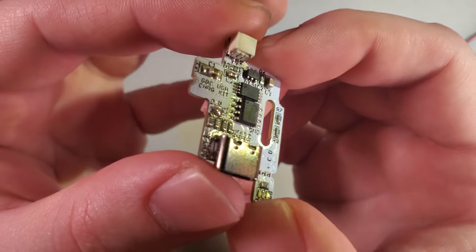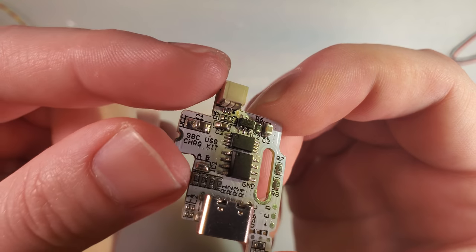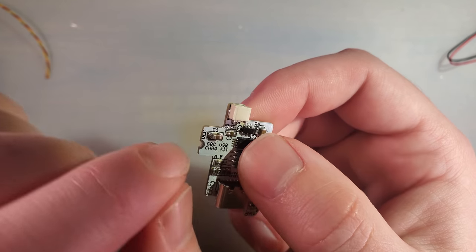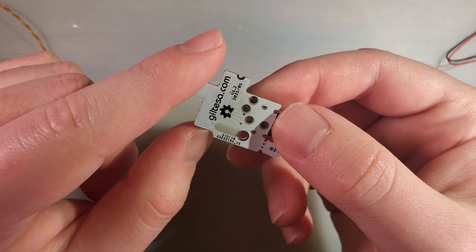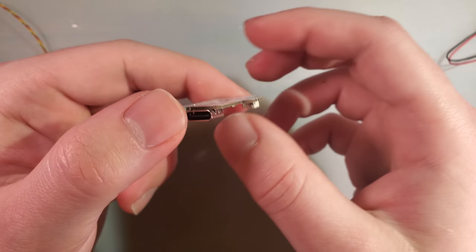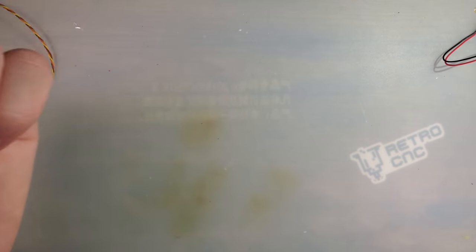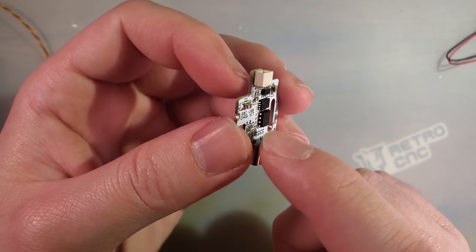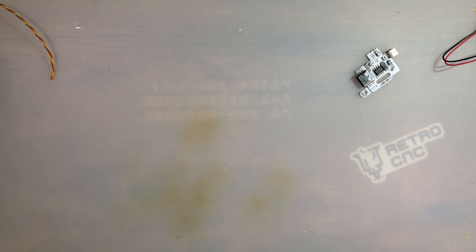This does require quite a bit of soldering, and just a quick heads up — this is probably not an issue with most kits, but I did notice it is a small issue with mine. It looks like this C1 capacitor shifted during component placement and this left pad is not soldered on very well. It's really not that big of a deal because this sort of kit requires quite a bit of soldering to install anyway — it'll take five seconds to just touch up that joint. But just as a heads up, if you have one of these, make sure to do a quick visual inspection of all the solder joints. I suspect mine is a one-off, but it's always worth being vigilant.